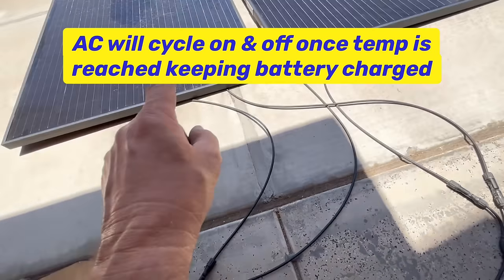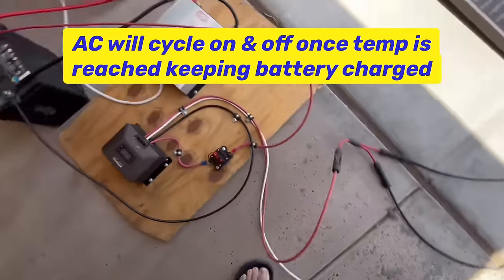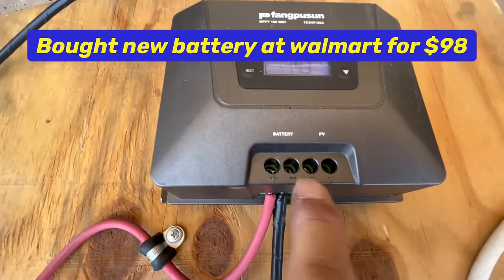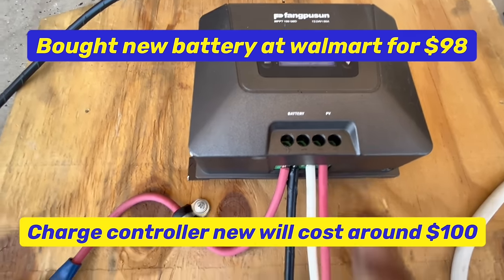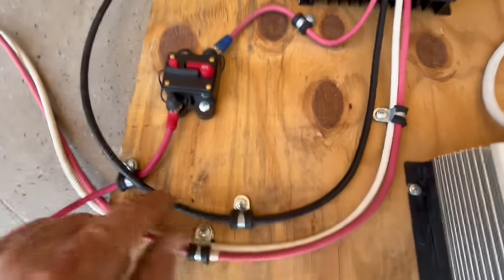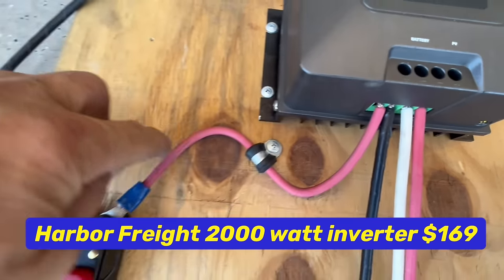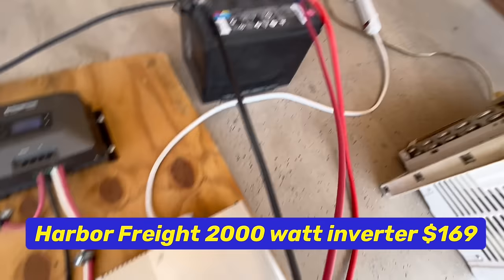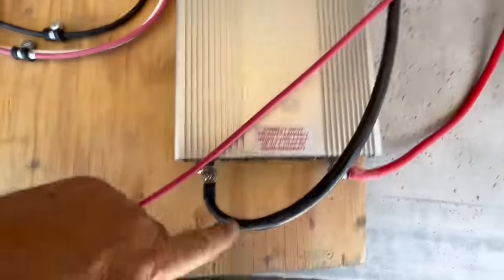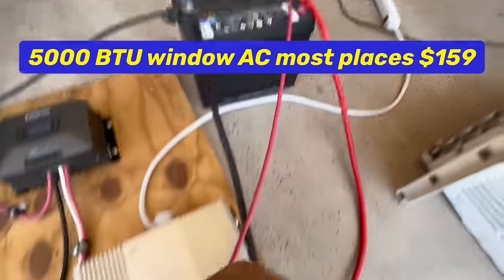And then we have the positive from both solar panels coming in here, making one in this branch circuit. The red goes into the positive of the charge controller and the white goes into the negative of the charge controller for the PV. Then we have the battery connection — the negative black wire goes over to the battery, and the positive goes through a 60 amp fuse into our battery. Then we have two cables, three feet long, that go from the battery negative to the inverter and the battery positive to the inverter positive.